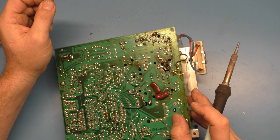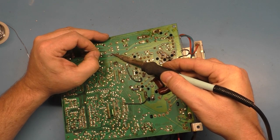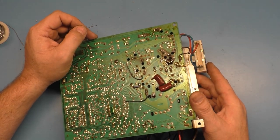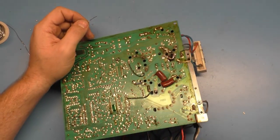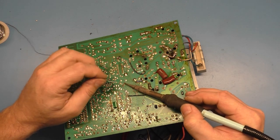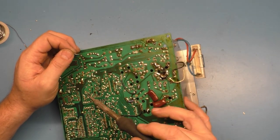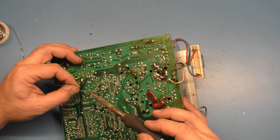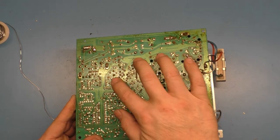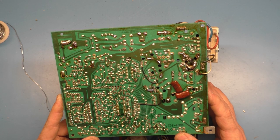Voltage regulator seems all right. All right, so we're gonna get a new C38 installed, then we'll go through and test all of our other components. If everything passes and works, then we'll give it a try. Ribbon cable is always pretty thin on the solder for those, both ends here. There's a ribbon cable right here. It always has iffy solder joints on the two connections, so I always check those. I think that will suffice for testing here.